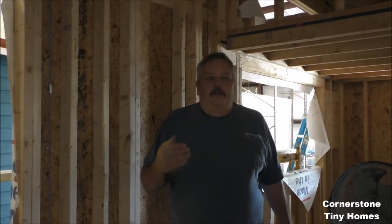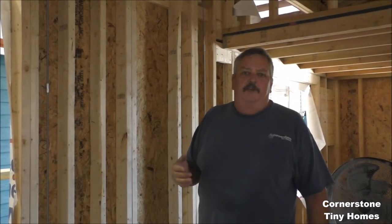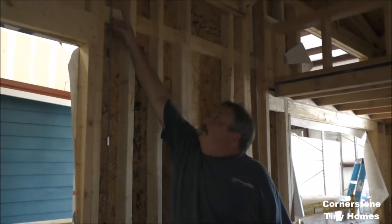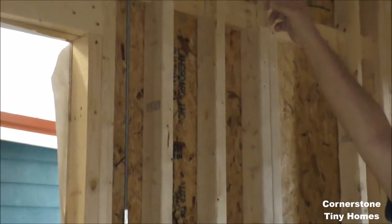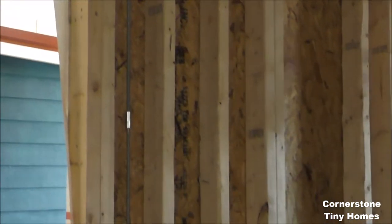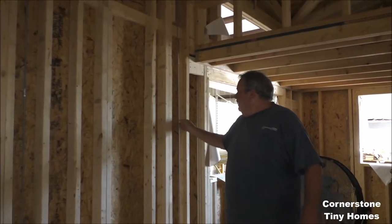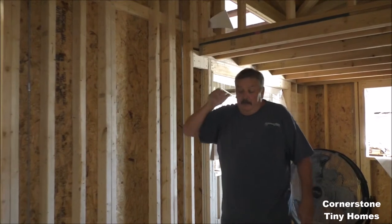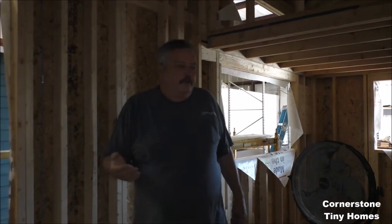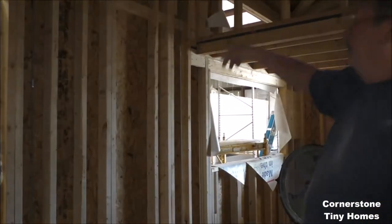Now, Cornerstone — I'm not sure how many people are doing this — but this is what we do. We've done this for years with our full-size structures too. It's a bolt system that we run to the ceiling and then all the way from the roof line down through the house, on each side of an opening, one in each corner, and then every four feet throughout the house. Typically our 28-foot homes have about 30 to 32 of these bolts in them. I'll show you how we can tie it down, but I wanted to show you how these things are actually connected.